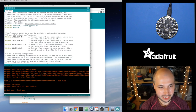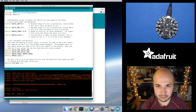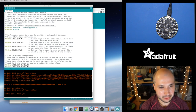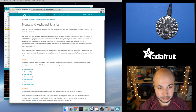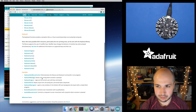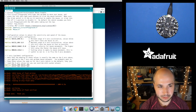Let's run through the code for this sketch. It's pretty straightforward and a good example of linear interpolation — probably one of my most favorite algorithms, I use it so much. In the example, the first thing is you include the Circuit Playground library, and also Mouse.h — Arduino's mouse and keyboard library. They did a great job building a very simple class. You can make your board look like a mouse, call a click function or a move function. The same exact thing works for keyboards, so you could set up capacitive touch keyboard presses if you wanted.